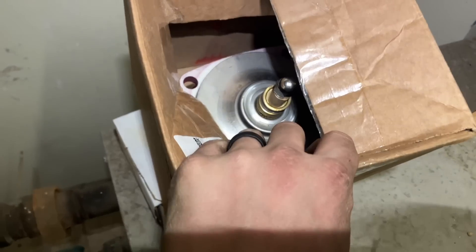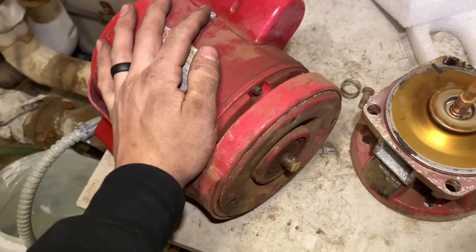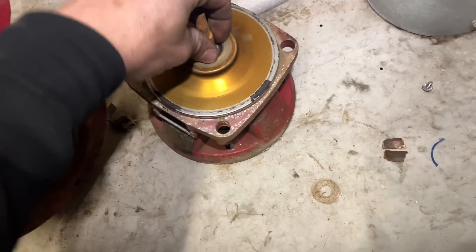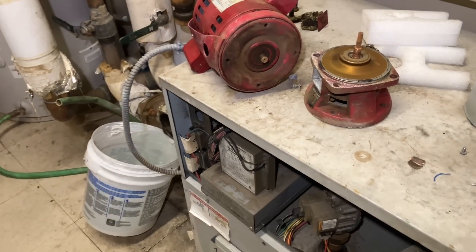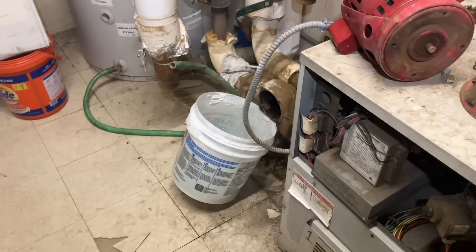This thing's locked up — that doesn't even sound good. This bearing assembly is going to do absolutely nothing if the motor is locked up. And besides, someone threw out the impeller for this, and it's going to be impossible to try and line it up. So the motor's bad, we don't have the impeller — we're just going to have to put a whole new pump on.